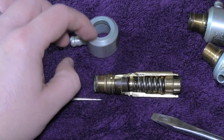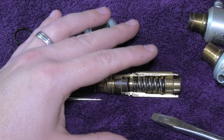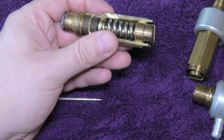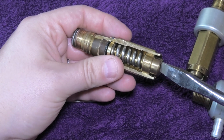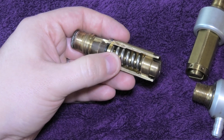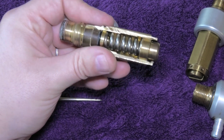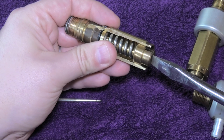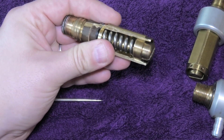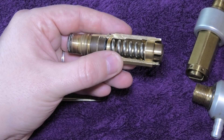Sometimes these can back out. So if you have got a pressure gauge on your pump, you would see that the pressure has increased. Obviously these are not foolproof — as you can see, I've got three of them in front of me. If they're not lock-wired off, you'll find that from the vibrations of the pump and the machine, they may start to back off a little bit, only ever so slightly. So over the course of time you may have to readjust these. Also if that seat wears, you will lose a little bit of spring tension. Even just a quarter of a turn on here can be the difference between this cutting out at 250 bar or 260 bar. That's why you ideally need a pressure gauge on the pump before you start messing with these.